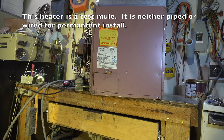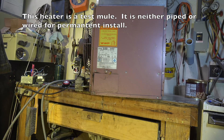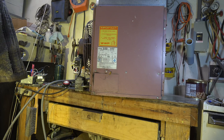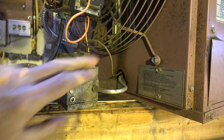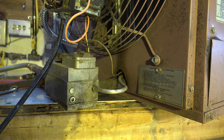So what's wrong with this unit heater? The pilot won't stay lit, and I'm going to show you that in a minute. Looking a little closer, we've got an old antique ITT valve, thermocouple, and pilot line. So the pilot won't stay lit — let's see if we can figure out what's going on.